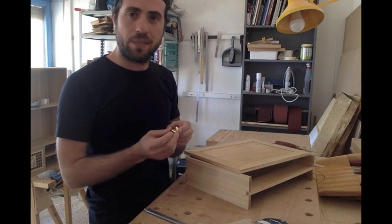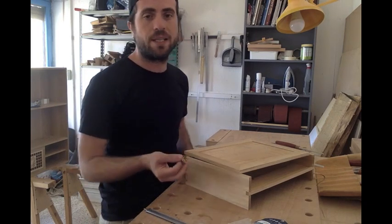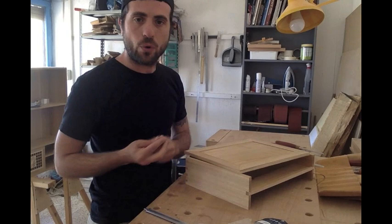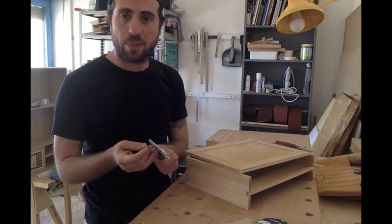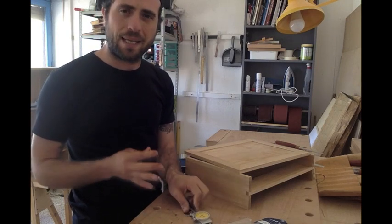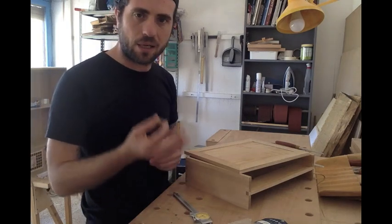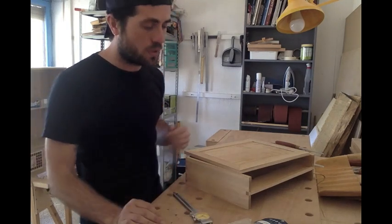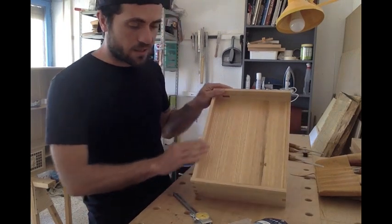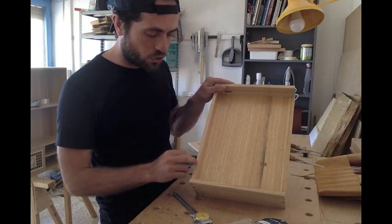It is about 19 millimeters long, and I use Brusso because they are high quality hinges and they ensure good consistency on the thickness and the size of it. So when you take the dimension with a caliper and bring it into your work, it is pretty consistent and you don't make any mistake. Something that doesn't always happen with other kinds of hinges. But in the market there are good quality hinges that you can choose. That said, one thing that I usually check is the thickness of the carcass, and it has to be right for the hinge that you choose, in order to leave a little bit of a ridge in front of it.